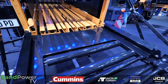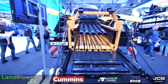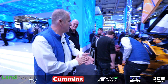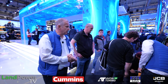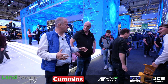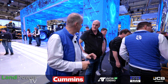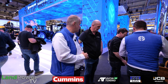The big new feature on the 1270 Plus is a completely new cutting unit — and it's clearly already popular! We have our new ultra cutter. The 1270 and 1290 normally came with 29 knives, but here we now have the new ultra cutter, which has 57 knives, bringing the cutting width down to around 20 millimeters.